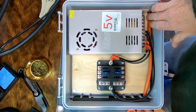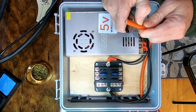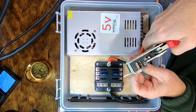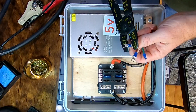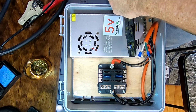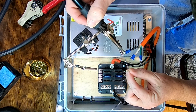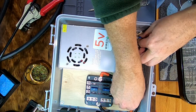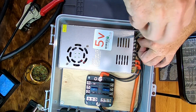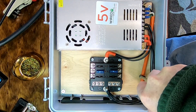The AC mains power is fed into the box using an outdoor rated heavy duty extension cord that I cut the outlet end off of. You have to be very careful knife stripping the insulation off the outside because you don't want to nick the wires inside. More spade terminals for the connections, but this time I left the blue plastic insulating sleeves on the terminals. I'm not going to put heat shrink on these because I don't want them marked red and black — I don't want anybody thinking these are part of the 5 volt DC system. And some sort of strain relief is necessary because this cord is going to be running across the yard and could get tripped over or stepped on.